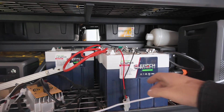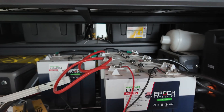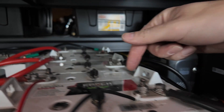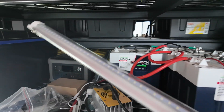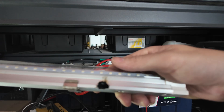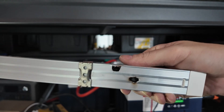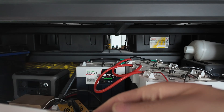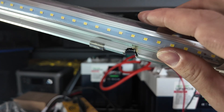Just to show you how powerful these batteries are - 51.2 volt batteries. I have these Epoch batteries sitting here. The last thing I had done was charge them up and they'd been sitting for a while. I left them all on and these are exposed terminals. The terminals are burnt here and burnt here. What I had done was I had an LED light that I was going to plug into the Bluetti to get some light, and I dropped it right onto the contactors for that battery. You can see what it's done - that's aluminum - and it was just a flash, enough to torch right through that aluminum like nothing.